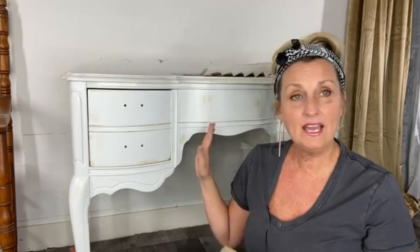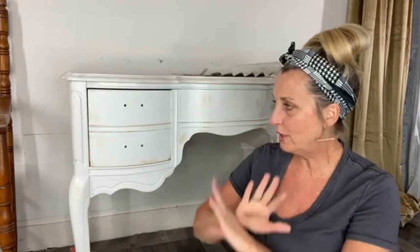If you want your finish to be smooth, you have to smooth your substrate — you have to smooth the surface you're going to paint. Now, remember the piece we did last week — the table with the Sea Spray? We were adding texture to our paint. If I had wanted an old-world look here, I could have added Sea Spray to my paint, left all the brush strokes, and they would have been fine because we would have covered them up with a texture additive. So that's that — we are prepped and ready to go.